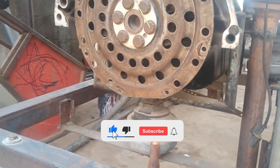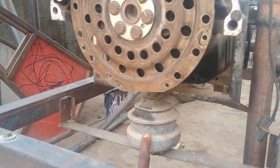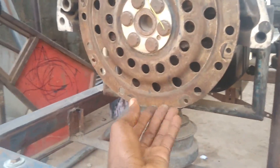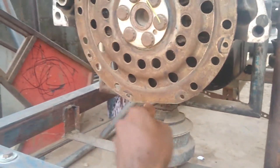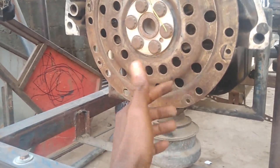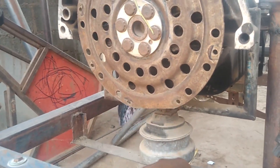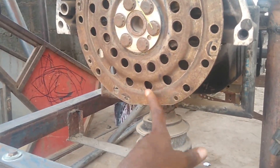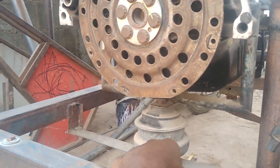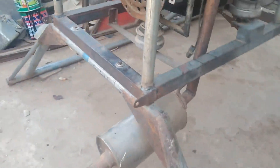This one over here is the front engine mount. I designed it this way because of tensioning — so if I install the automatic belt tensioning, it can automatically tension the belt and also release the belt. You can also call it a clutch actuator. That's how I was able to construct this mount.